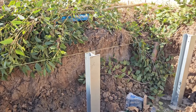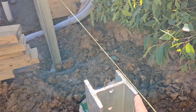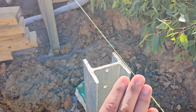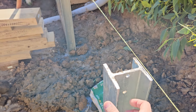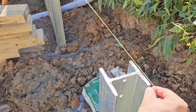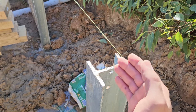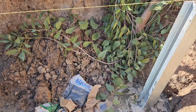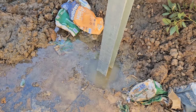The post has an angle. How we install it: we make it level 15 millimeters from the line, then push it back to the line, because it needs to have the angle as the engineering details say. We level it in two directions — this direction and that direction — 15mm, one and a half centimeters from the line, then push back to the line, because it needs to have a slope toward the weight behind it to be stronger.